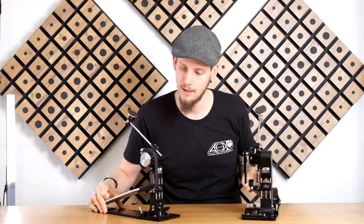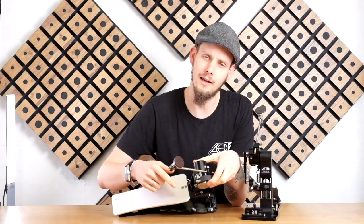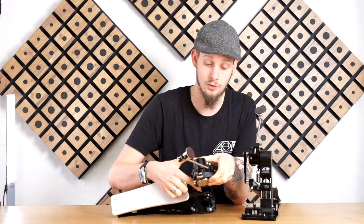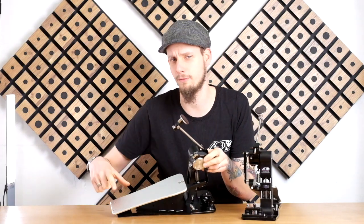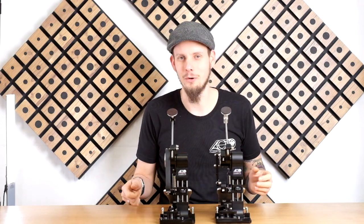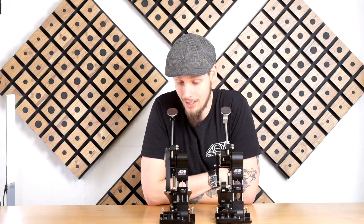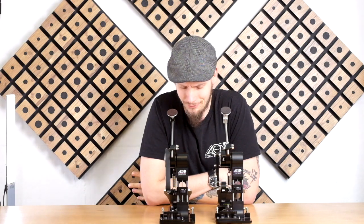On the strap drive, there are reference marks with grooves milled into the top part. I like to look at the nut that locks the connection part of the strap and see where the corners of that nut line up with the grooves. That gives you a quite good reference point and an idea of where you started and which direction you went when experimenting.